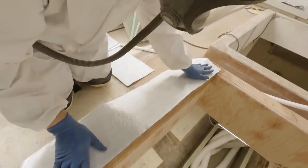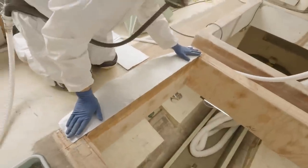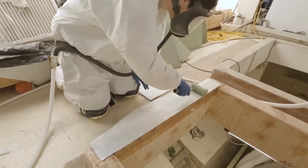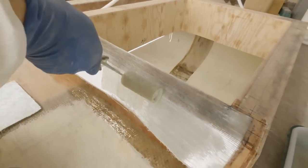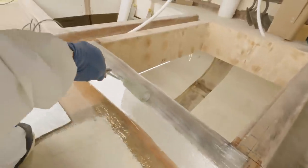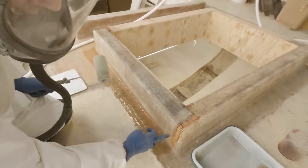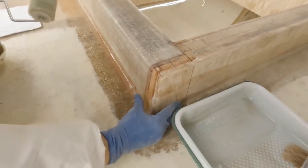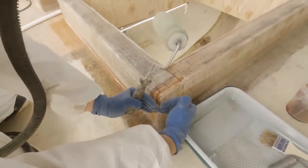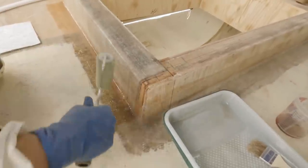Inside, we just knock the inside edge down real quick with the grinder or whatever. Came up short on the corner. That's because I plan on just putting a single piece of fabric, the full layer, the full layup right there. That way the corner doesn't have the end joints right there. It wraps around it. I'll transfer all the strength pretty well into the glass beside it.